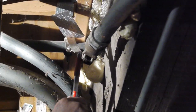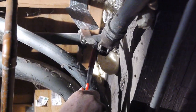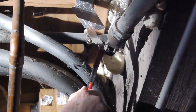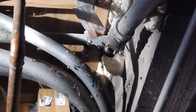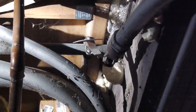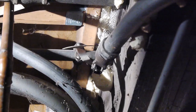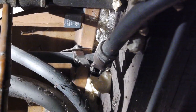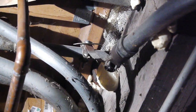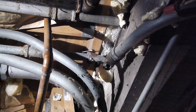If you don't have one of these in your building, or if you don't have a driven electrical ground at the building's exterior, you're going to have a major electrical problem. Take the 20 minutes to examine your own home and look for this bonding strap, this tag, and the wire next to it that illustrates that the equipment is properly grounded. Less than one percent of all buildings I look at don't have this. Electricians tend to be very cautious and their work overall tends to be good, which underlines the importance of having a licensed electrical contractor and not a handyman doing your work.